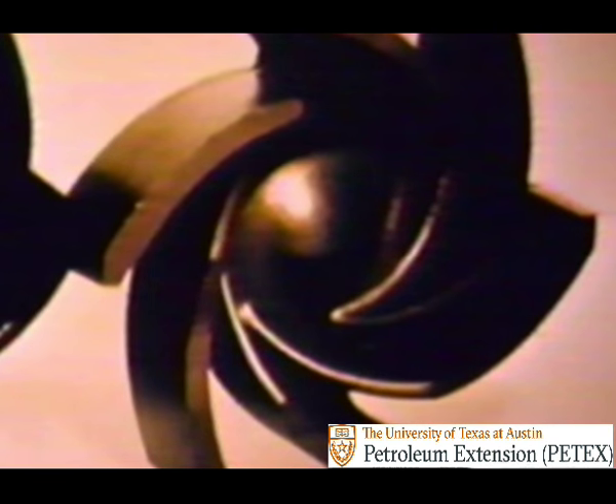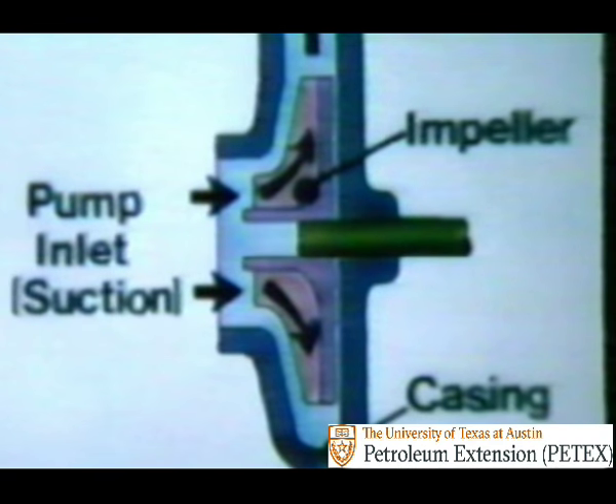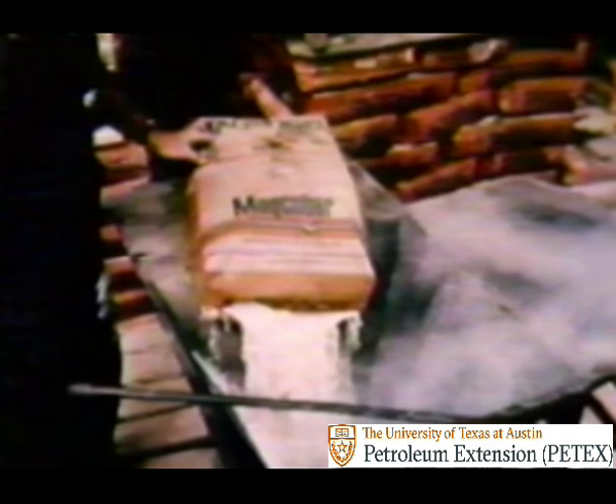The centrifugal pump works along the same lines as a fan. The blades of the impeller create a suction when they rotate, which draws mud into the pump inlet. The mud is then sucked into the impeller casing and whirled around and out the discharge nozzle. Like a fan, the centrifugal pump works best for low pressure, high volume jobs, such as mixing up the dry mud components.